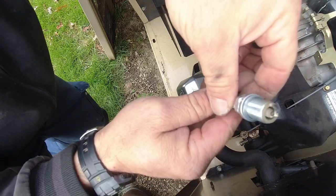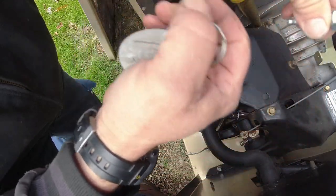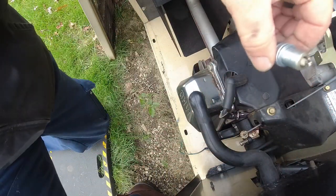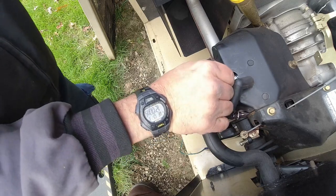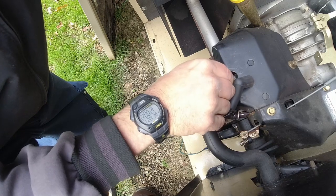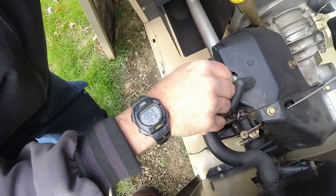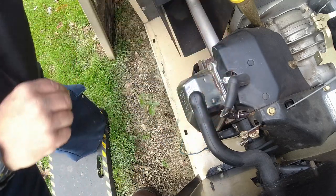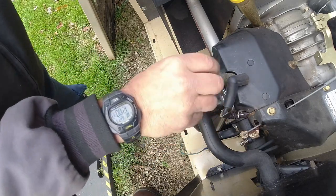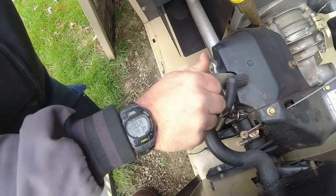Yeah, it's burning fairly decent. Yeah, it's right at 30 thousandths. It may have been what it was, so we're not out of range. I'd have to pull it up to remember. This is running on propane. Propane, they would sometimes go with a smaller gap. Didn't always make a humongous difference, but it was something that they recommended back in the day. Don't know if they're still doing that, and it was only on this particular series.